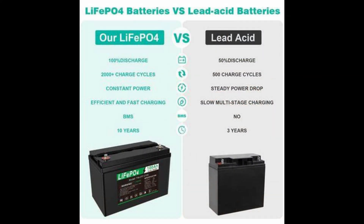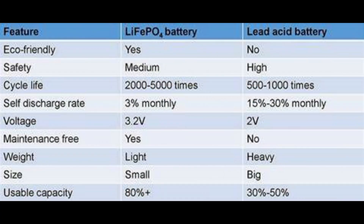The other important thing you need to know is that that battery is not actually a full 100 amp hours usable. If you were to use all 100 amp hours out of that battery, you would have fully discharged it, and that damages the lead acid style battery pretty heavily. Do that repeatedly and you can rapidly kill a brand new battery. For the sake of operating it off solar, you're really only supposed to go to about 50% state of charge — so if I have a 100 amp hour battery, I'm really only going to be using half of that gas tank, and then I have to refill it.